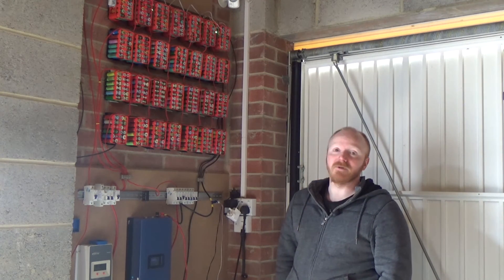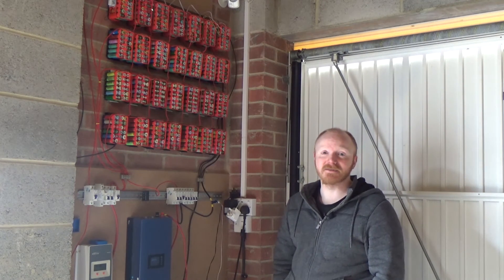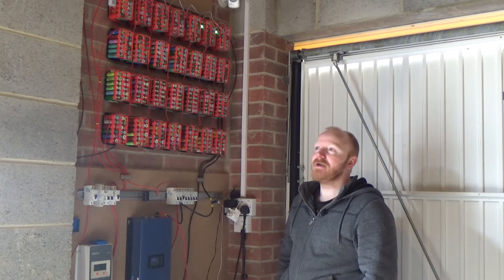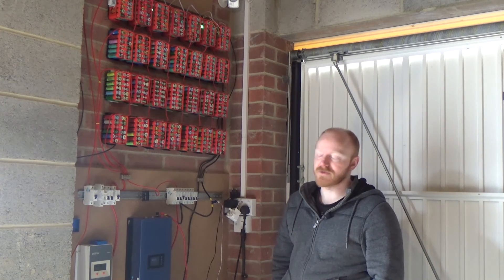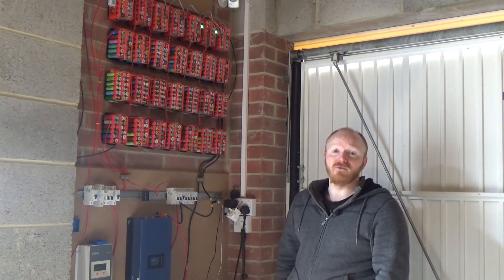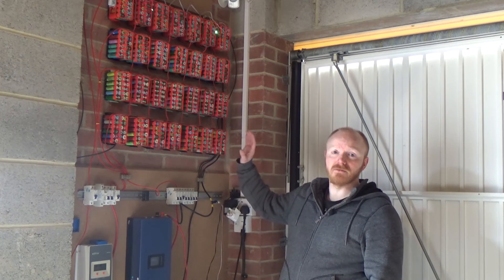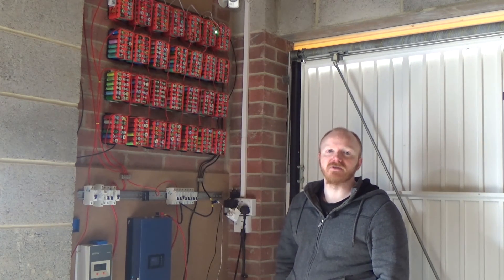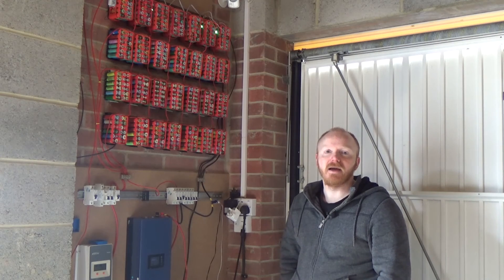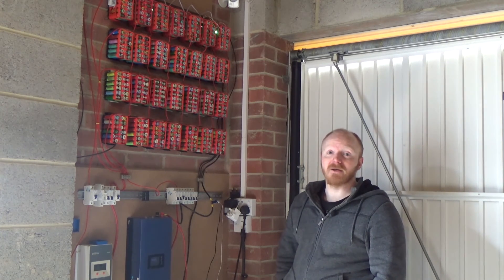Going forward, I'm going to try and get things going again. I've actually purchased three new solar panels, 300 watts each. The idea is to have them mounted directly on the garage roof here and get those hooked up. That'll give around about 900 watts of power, which fits just under the limits of the charge controller I've got — a really good, usable amount of power. During the day I should get enough to charge the power wall, probably power the house as well since my usage during the day is pretty low, and keep that pack topped up so for a few hours into the evening I can be pretty much free using the electricity I've got in the power wall.